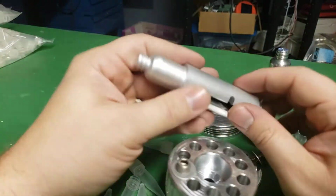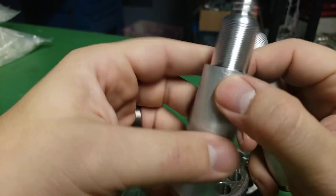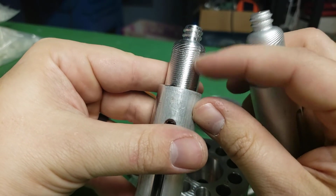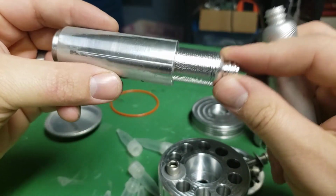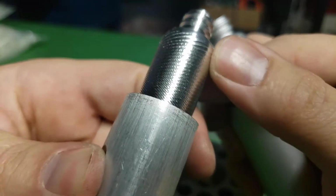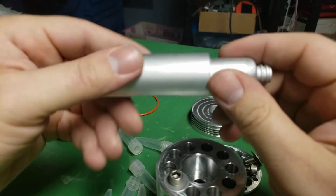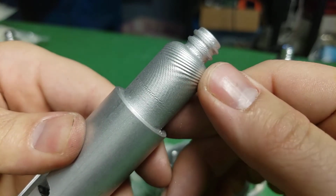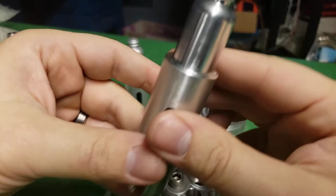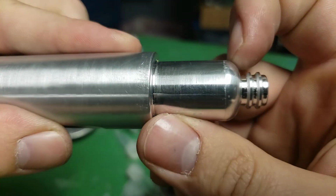I did make a couple of these. So this was my first attempt. And you can see the chatter. So this was the feeds and speeds were not right, and this vibrated as it was cutting, and it creates this cool spiral effect. But cool, but not what I wanted. So then I made a second one, and you can see that the vibrations are definitely better. So my feeds and speeds had improved, but were not there. And then this is straight off of the machine if you get your settings right, and it's really smooth.